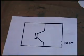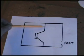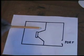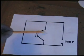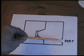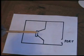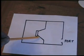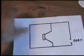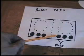The other type, which I class as the best, is what's known as band pass. It looks a bit bizarre but it's a very simple design. What you have is an enclosed box with the speaker inside. When the speaker moves out, because it's an enclosed box, this part here is almost causing a vacuum, so it gets pulled back really quickly. Here you have another chamber, and that's the port — a tuned chamber matched to the speaker. Looking at it from the front, the dotted line is the speaker behind a big baffle board, and the big black dots are the ports — that's where the sound comes from.